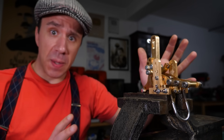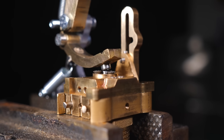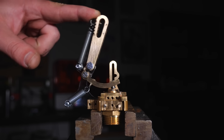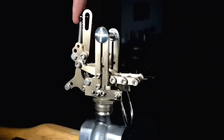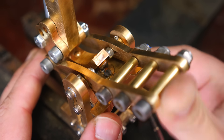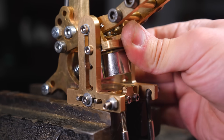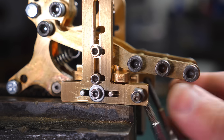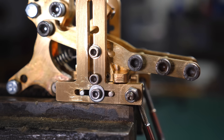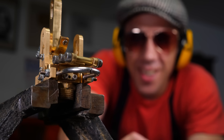The reloading mechanism is now ready. The hammer that strikes the pin that then strikes the primer on the shell is held in place by a simple trigger mechanism. The locking part is stuck in place until the axe hits — the impact moves it forward, which unlocks the hammer and kabam. When I move the lever up, it pushes the hammer into its locked and loaded position. It tilts the base so it's easier to remove the spent shell. I can then reload a new shell, lower the platform — and my favorite part: push the sliders back to lock the platform in place so the nasty pressure doesn't come out the wrong end — being the wrong end, my face. The mechanism is now locked, loaded, and ready to shoot.